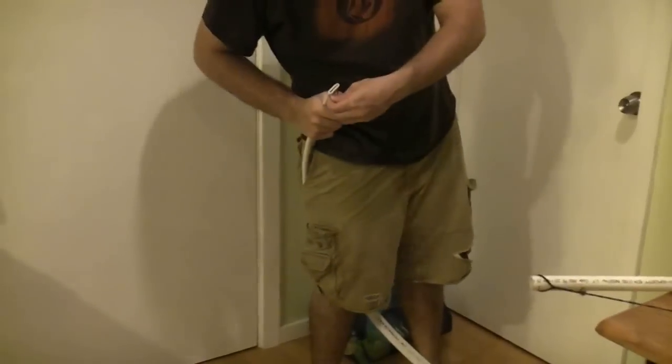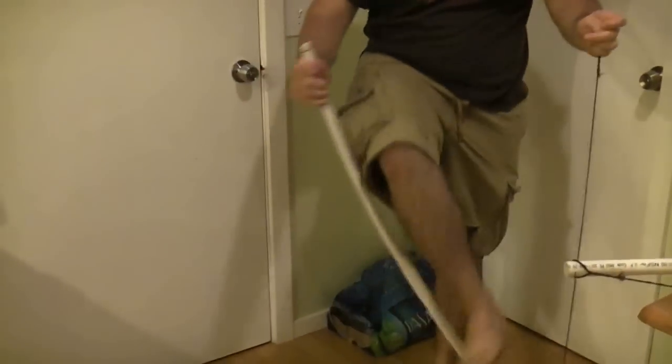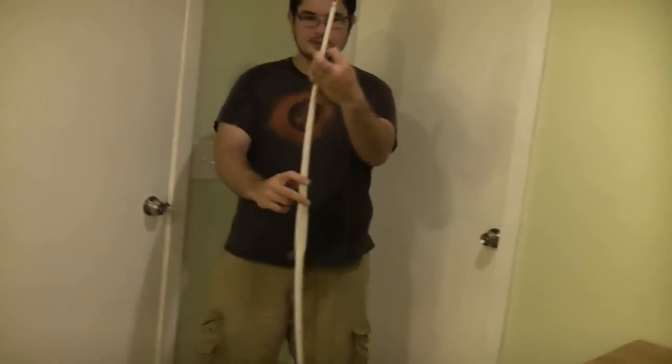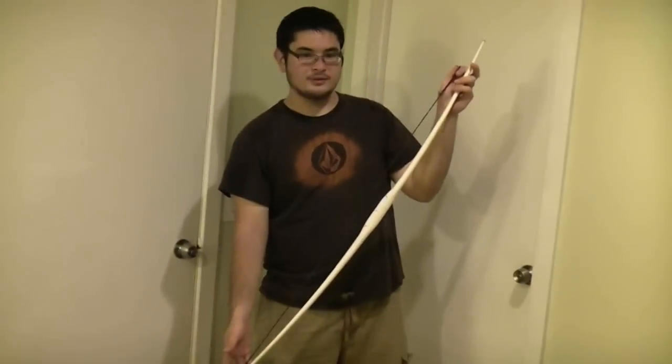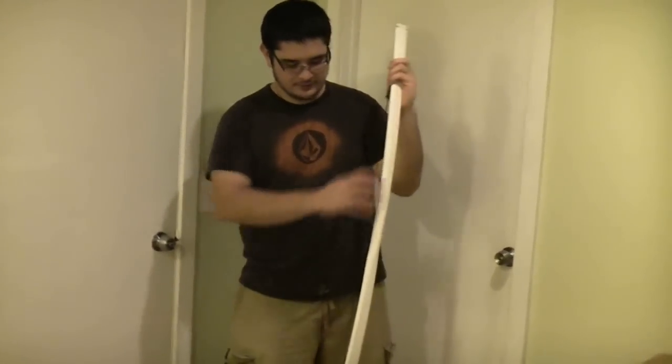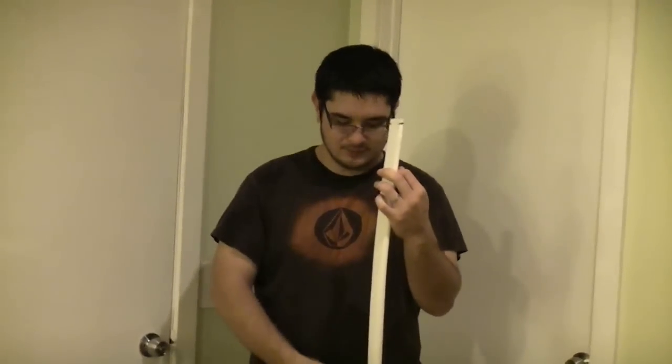So in conclusion of this whole draw weight portion of our comparison, what I'm going to do is unstring both of the bows and you can see what they look like after being fully drawn a few times. So here's our flattened pipe. As you can see it's gotten some set — mainly taken set in this portion and this portion of the bow. This is the main reason why I recurved the bow, just to get a little bit, because this is inevitable. PVC is going to do this. This is less noticeable on a larger diameter, or if you just made this longer — if this were five feet you would hardly notice any string follow at all.